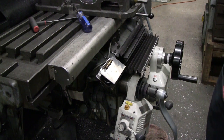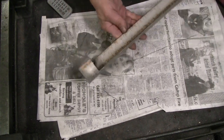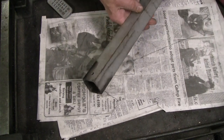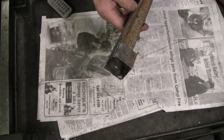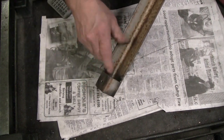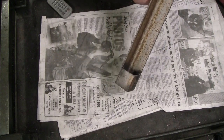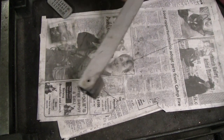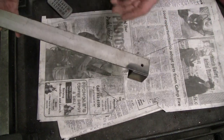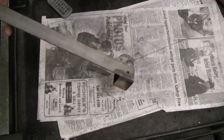My last issue is to protect the scale itself. Here's what I came up with for a guard. Piece of scrap angle iron, long enough, with a couple of angle iron clips, cut off and welded, just a good heavy tack weld in each corner, both ends, long enough to span the full length top and bottom. Drilled some quarter inch holes and tapped them 1/4-20 in the base of the mill. Go bolt this on, we'll be done.